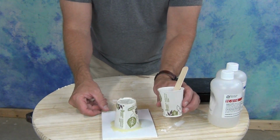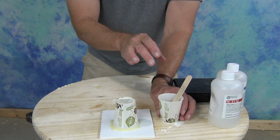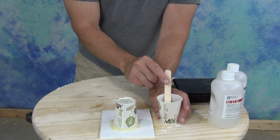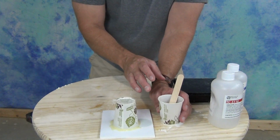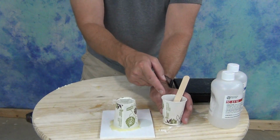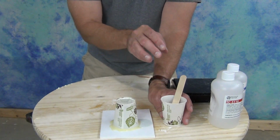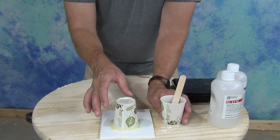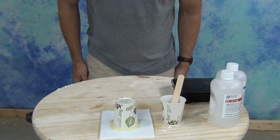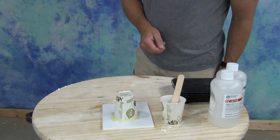Now again, as I point out in other videos, always a good idea to keep your batch, your leftover silicone to the side, because that allows you to grade your work later on. If there's any problem with this mold, we can always gauge it against this control right here, because we know this doesn't have any contaminants, any sulfur clay or anything like that. So if we ever have cure inhibition, we can always go back to our mixing cup and use that to grade our work and see if there was anything going on here. Because if this cured fine, but this did not, that's a good indicator that you have some kind of contaminant on your pattern. So now we're ready to wait the requisite 2 to 3 hour time to demold, and we'll see how our part comes out.